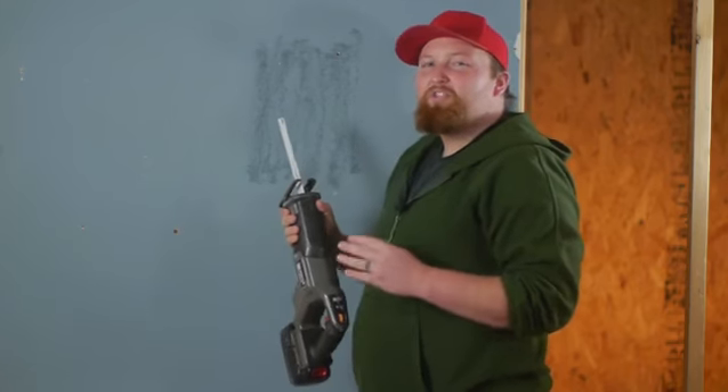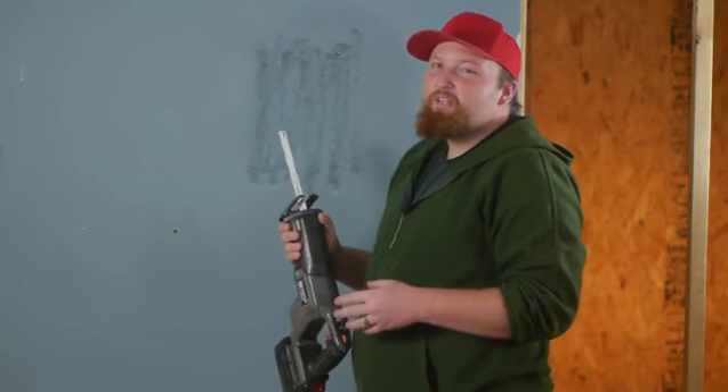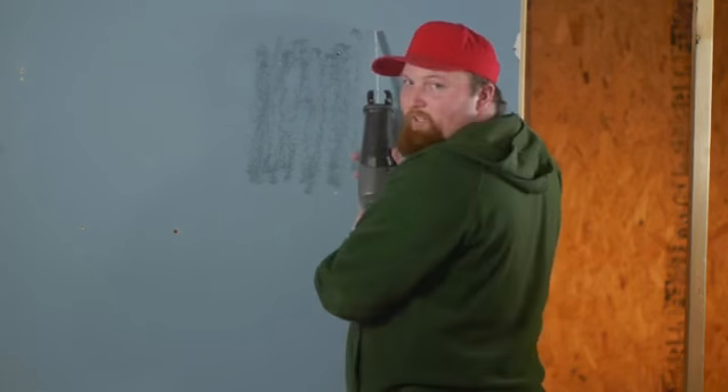You also want to be careful that you don't cut through any studs, especially on a load-bearing wall. So we're going to cut out this damaged area of wall here. We'll take our saw, place it against the wall at as much angle as we can get on it, and slowly start reciprocating the saw back and forth to poke through the drywall.